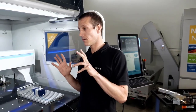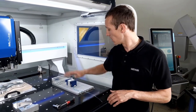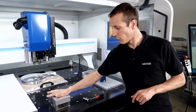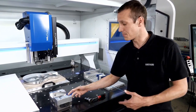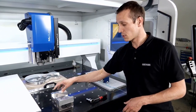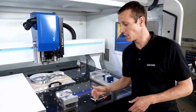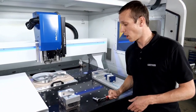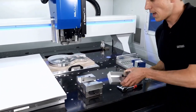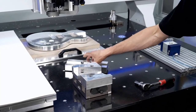Besides the vacuum clamping technology, we also have mechanical elements to hold our parts. We got the pneumatic one, which we'll look at later. First, the centric vise — a standard vise with soft jaws in this case. Aluminum soft jaws can be milled to any contour or shape your part requires, or simply used as a parallel step. It's also possible to get the vise in a longer version with wider soft jaws.